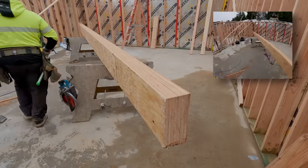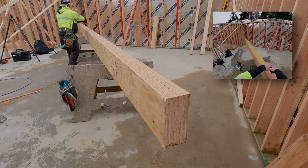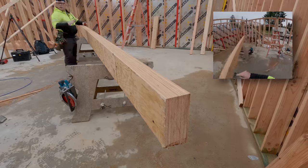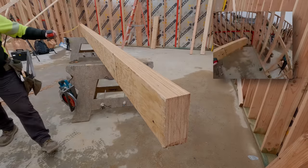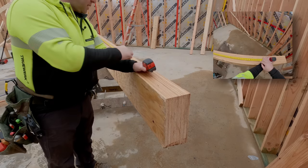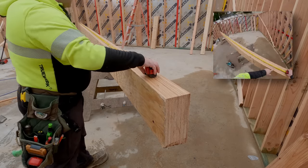I have 278 and 3 eighths outside of that wall to outside of that wall. 278, 6 — so 3 eighths is 6 sixteenths. I always cut just a little less: 278, 5.